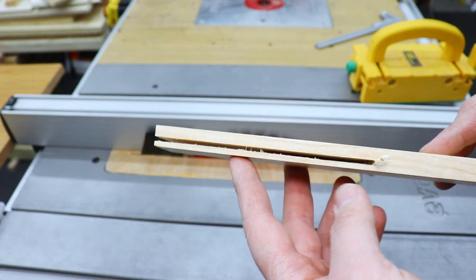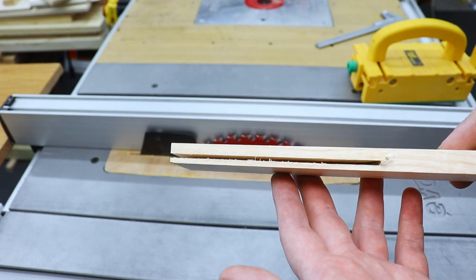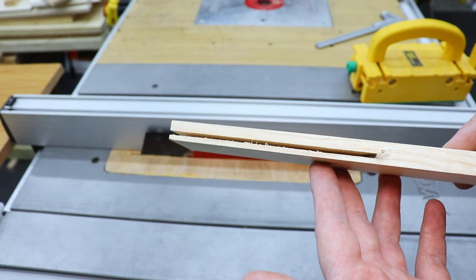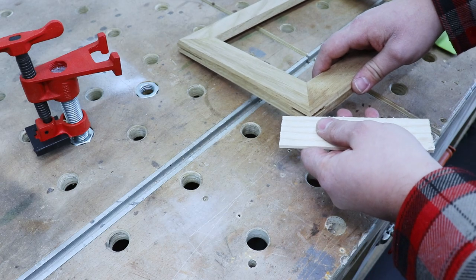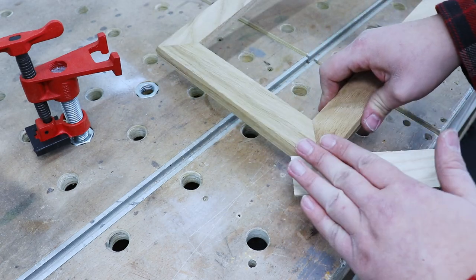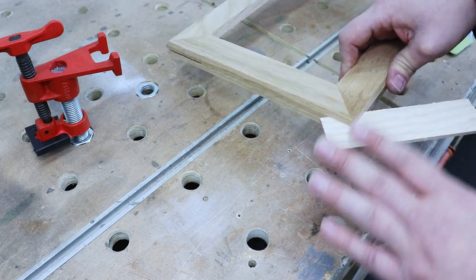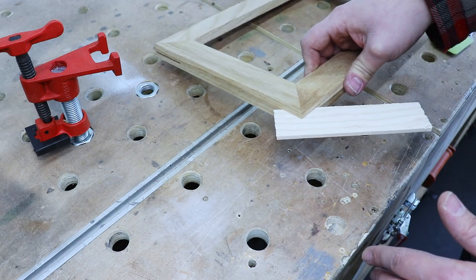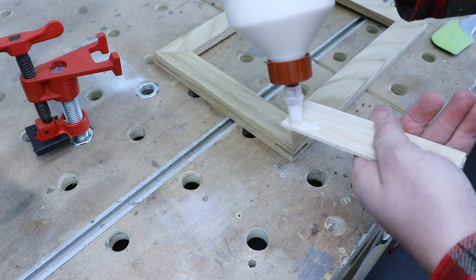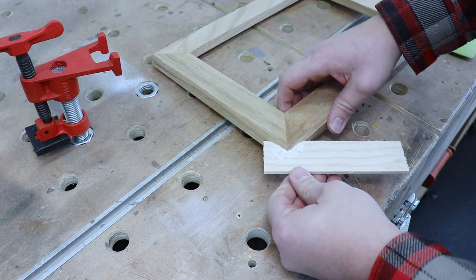And there you go, that's enough for my needs. I don't have to go for the whole board. Obviously if you don't feel safe doing that, a bandsaw or a thickness planer would be a better option. I've got my spline ready so it fits just in that groove, and I really do like this method as it gives you contrasting pieces of timber and the looks of the picture frame are so much better. So now I'm going to apply a bit of wood glue, whack it in place, leave it to dry, and then with our saw we're just going to cut off the excess.